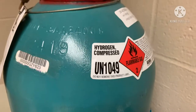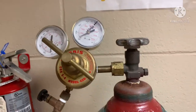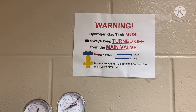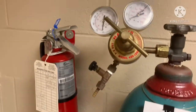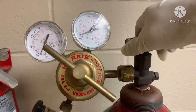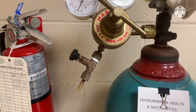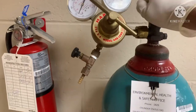This is the hydrogen cylinder — normally it is kept in a secure place in the lab. Hydrogen is very flammable, especially in the presence of oxygen, so while you are dispensing hydrogen make sure you are doing it very carefully. There are two knobs: the main valve on top you have to open first, and you will see the regulator indicator go up once you open it. Then you open the second valve.